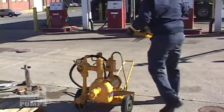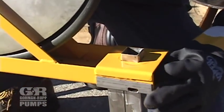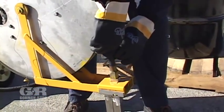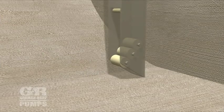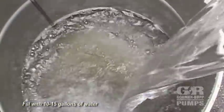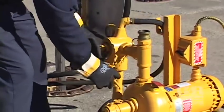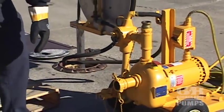Remove the reel assembly from the base of the tank cleaner and snap it into place atop the standpipe. The hose from the reel is then placed inside the standpipe and fed downward until the operator can feel the nozzle come in contact with the nylon rollers at the bottom of the standpipe. The operator then fills a storage container with approximately 10 to 15 gallons of water, ensuring the non-coupled ends of the hose will be completely submerged and will not withdraw under operating pressure. Next, removing the quick-connect fill cap from the discharge plumbing, the pump is filled with water.